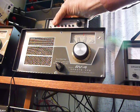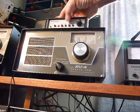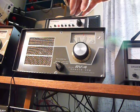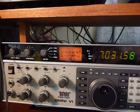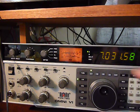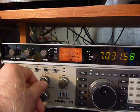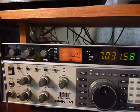The noise reduction is in again, plus the 500 Hertz filters are also being used right now. The radio I have set for 2400 Hertz because I didn't want to use the filtering on the radio. Now for the notch filter, I could probably — by using the notch filter — cut it down a little more. That knocks out even more of the noise.